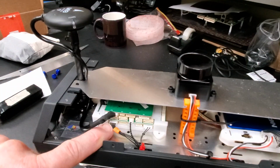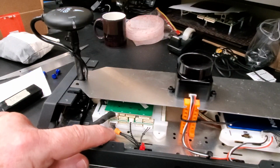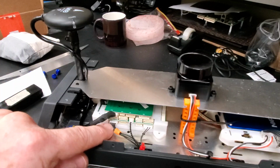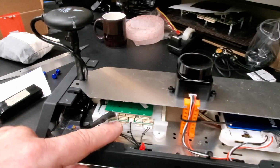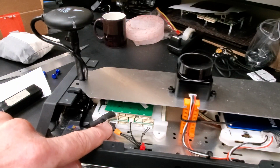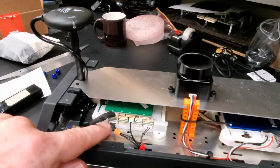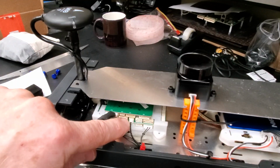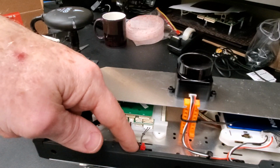Currently, the current version of the power distribution board requires this cable with the orange. It's basically just reversed. There was an errata on the first version of the cable. Next version, we're actually adding some power measurement, etc. But for now, if you have the first generation pre-production prototype, it will be this orange cable plugging into that slot. That is your T1 automotive Ethernet connection that goes in here, down this hole.